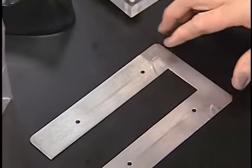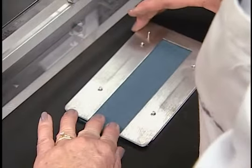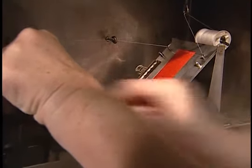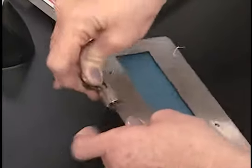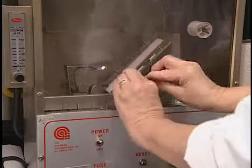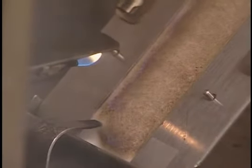The specimen holder consists of a top and bottom U-shaped metal frame. The top piece of the holder has hooks or thread guides on it for positioning the stop thread. The stop thread will have a weight attached to it. When the thread is burned, the weight drops to stop the timing mechanism of the test apparatus. The upper and lower portions of the specimen are secured in place between the two pieces of the metal frame with clips. In the open area, a specified flame can be activated to touch the surface of the specimen at its lower edge at a particular location.